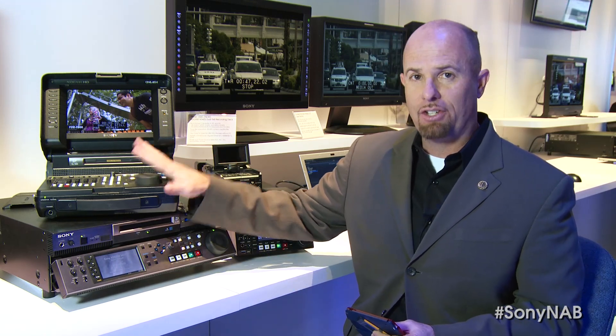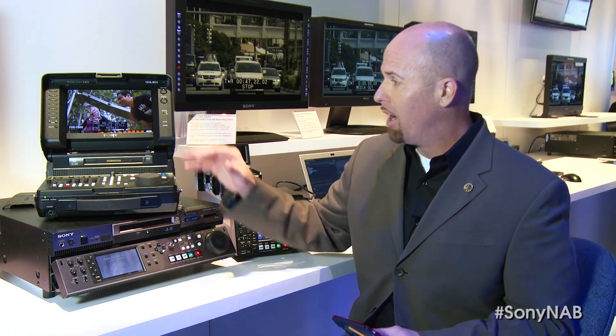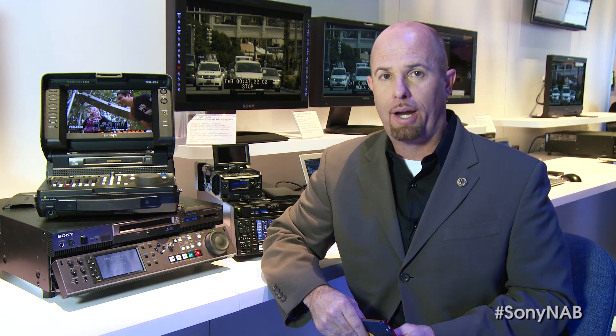On top of that, you can use this disk or drive as an ASI broadcast interface unit. So if you're using the deck for microwave unit applications, there's an ASI option that's around $4,000 roughly, and it can take it in and out or convert the output to 14 to 44 megabit rate. You can dial that in, and the extensions of this are dramatic. It's actually less money than an optical disk deck itself, but with a built-in display, something that can serve multiple purposes on one rental price — and the utilization is very high for reality programming.